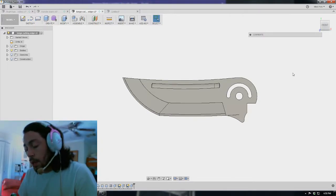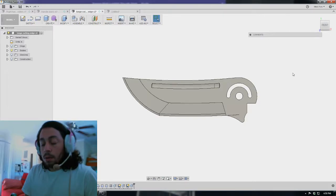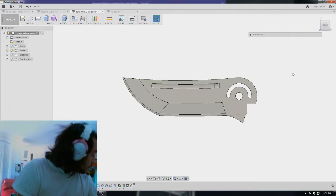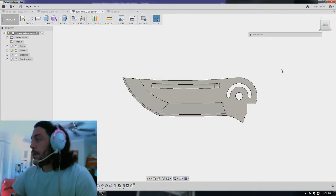Additionally, I could do the same process but with heat flame etching, or paint flame etching. Normally if you're making a hamon, you paint clay on in your pattern and then you heat treat it, or you heat it up, and then different compounds form in different parts of the blade depending on how quickly they heat up and cool down. And so when you etch that, different patterns emerge. That's why I wish I had my girlfriend's samurai swords around me. But yeah, that's why the wavy pattern is called a hamon, and that's how you get that. So I'm just gonna play around with that when I get it done.